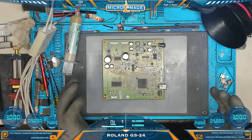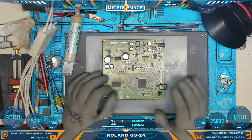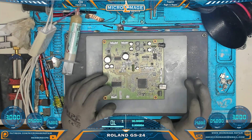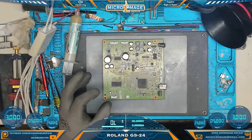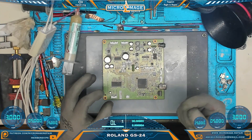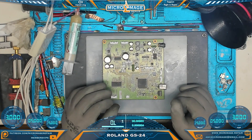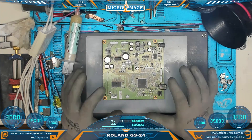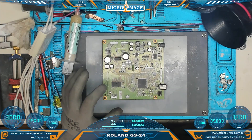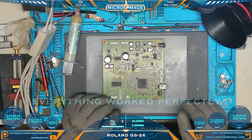Final verdict: I do believe we were successful in getting the port back on and everything connected. If I had it to do again, I would probably modify it a little bit. I like the idea of the pads, but not having wire fed through to the other side to wrap around the pins left too much to the imagination. So next time something like this happens, I might still do the pad technique but I'll probably run wire too just to make sure we're going to get that connection for sure. But other than that, I think it went pretty well.